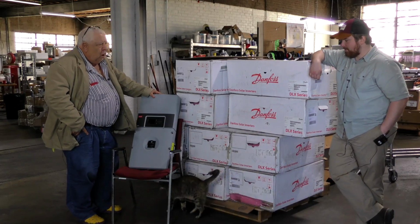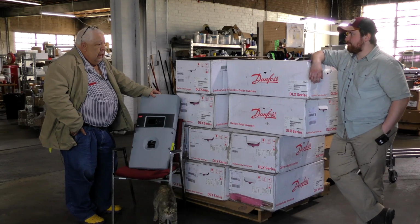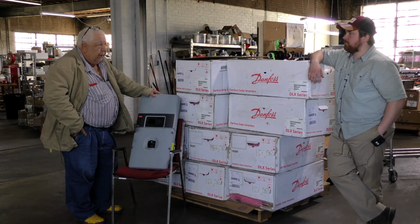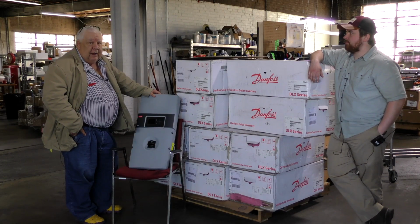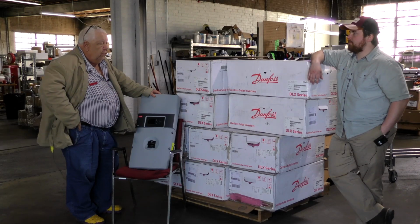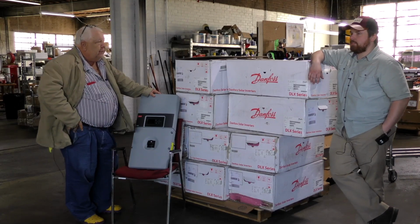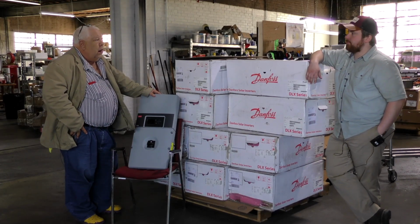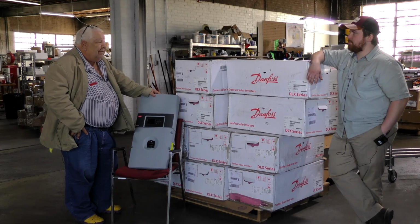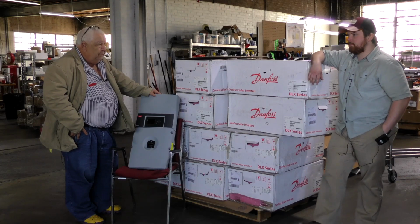And so let's talk about what a peak shaver would look like. It would monitor your usage from the grid, and if it got to a certain level, ideally below their peak threshold, for a certain amount of time, ideally less than the 15 minutes, you would kick on an inverter and battery that would provide some of the power so the grid never sees that peak.